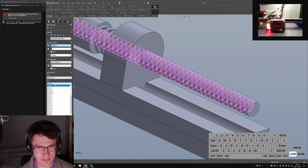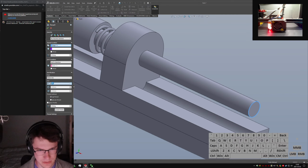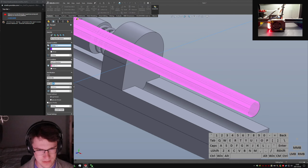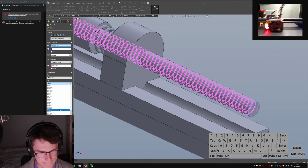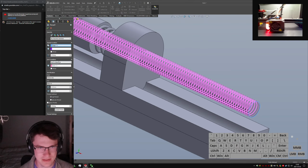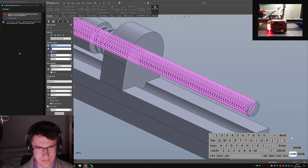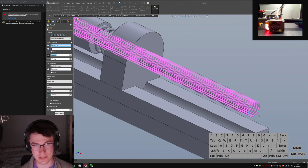Specification. Metric die. It's thinking it's an M16. It is not. M6? Nope. It just went for M. Kind of rude. Or M60. Look, I just want a thread. M6x1. Please. Oh, and offset this out of the part so I get a clean start on it.